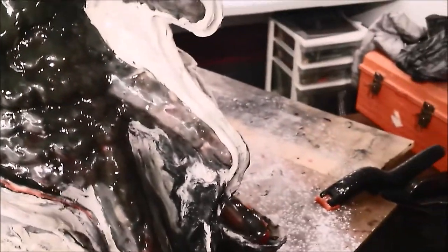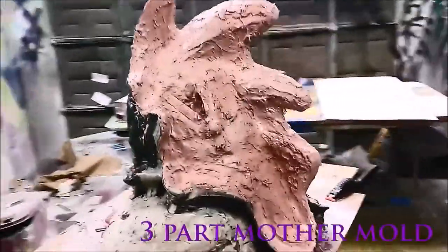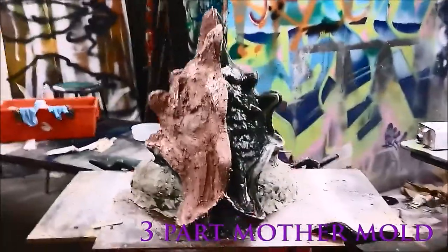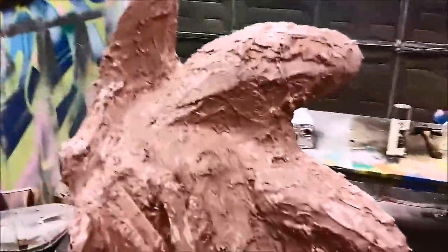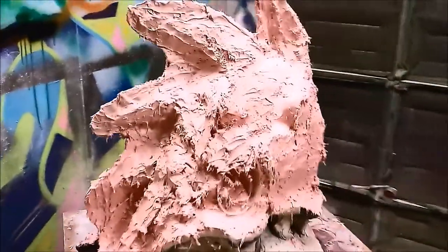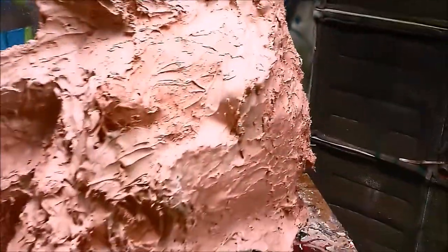When constructing a clay wall, be sure to incorporate a ridge and/or keys so the mother mold pieces lock together neatly. The clay wall must be made to section off the mother mold such that the mother mold pieces can be removed from the rubber mold without breaking. Imagine that the mother mold pieces will be removed in a single direction pull. Apply ample release agent — I use petroleum jelly for most hard molds. It's cheap, non-toxic, and widely available. I like to apply the mother mold in the same order in which I will be removing its parts because I'm using ridges instead of keys. With keys, the order doesn't matter so much.